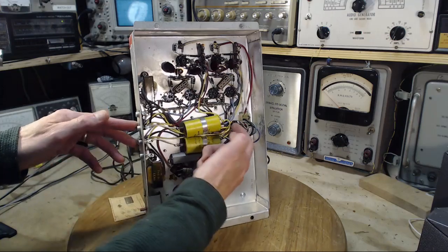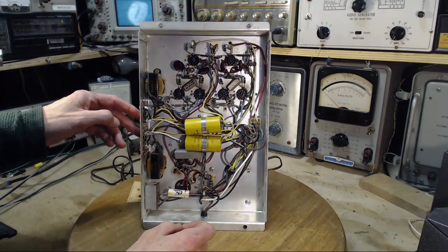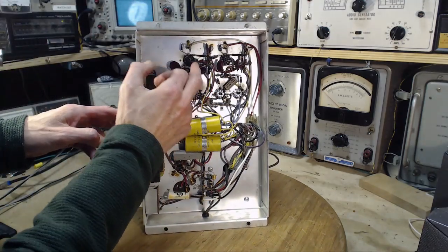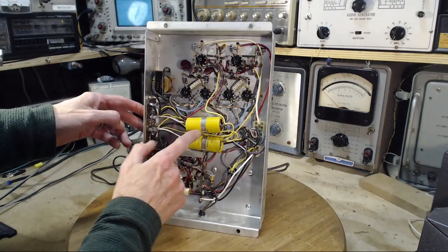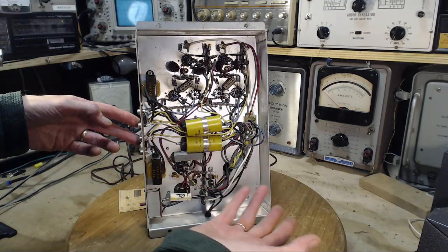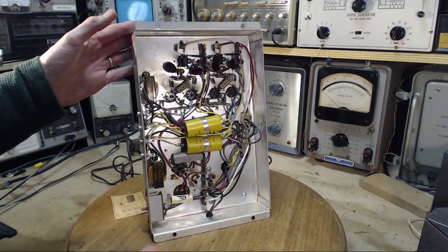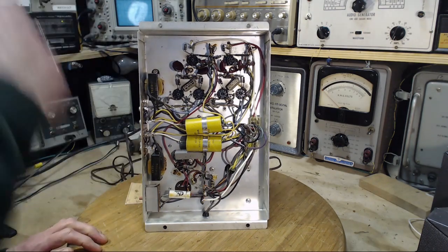What's this yellow wire doing going back this way? So it's possible this is feedback. It's very possible this is feedback. Ends up at a small capacitor and resistor. Probably that's the feedback. So, okay, well that makes it great then. I solved my issue. Where do I hook up speakers? Hook them up to the two everything spots. And I think I'm going to be doing this with clip leads. Or I could even solder wires in there.